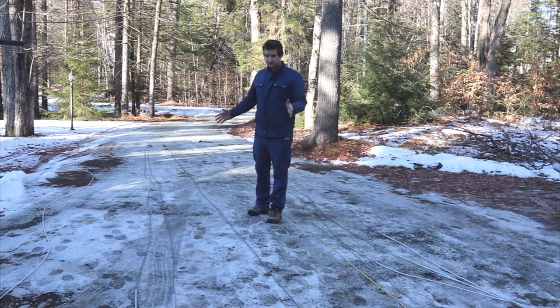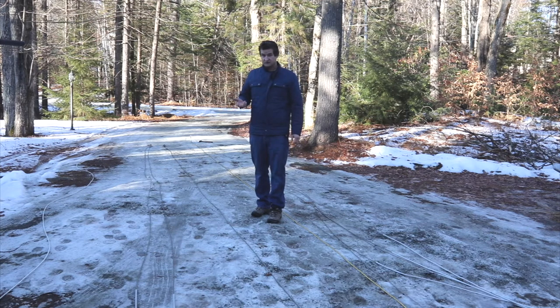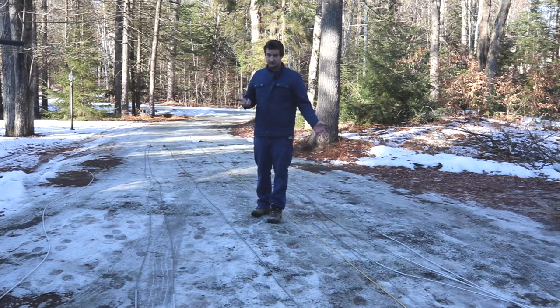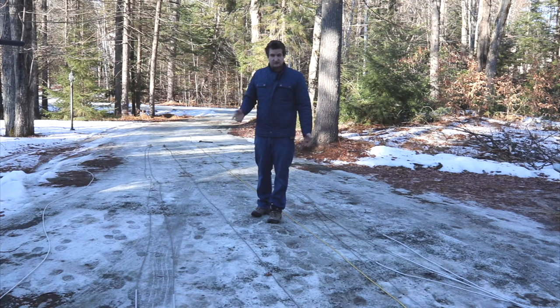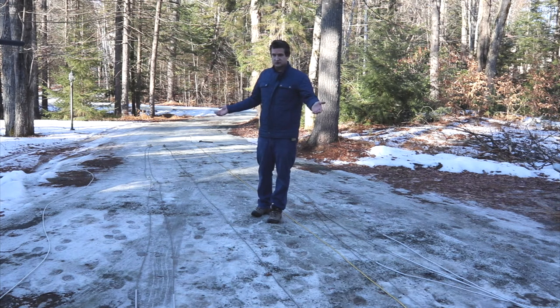So I've got the rigging all measured. I ended up just laying it out here on the frozen driveway — just hammered a screwdriver into the snow and stuck the shroud and the tape measure over it, and that worked pretty well. I was able to pull it tight and get the measurement. One thing I did notice is that a lot of the shrouds are different lengths. Even the lowers — they're four different lengths, when you'd think there should be at least two lengths or maybe all the same. Then the uppers are also different lengths. So this is making me a little nervous about getting swage fittings on both ends, because what if it's an inch too short or an inch too long? That would be kind of a big problem.